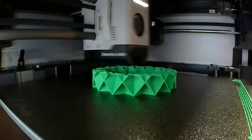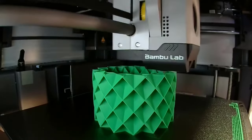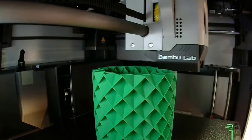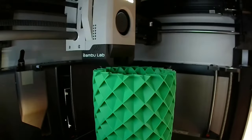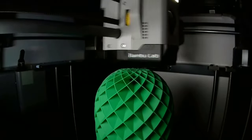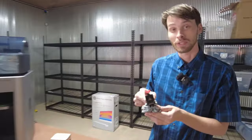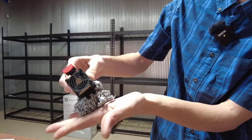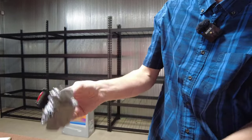Just a few specifications on this printer: 10 by 10 by 10 inch build volume. The chassis is welded steel, the shell is aluminum and glass, and it does have an all-metal hot end. There are different build plates — the standard cool plate for PLA and materials not needing a heated bed, the high temperature plate, and what it comes with: the textured PEI plate, which is an amazing upgrade from the smooth plate. On filament, it supports PLA, PETG, TPU, ABS, ASA, PET, PA, and polycarbonate (PC). And regarding spaghetti detection — here's an extreme example from one of our Raise 3D printers showing what a spaghetti failure looks like. This is what spaghetti protection prevents. The extruder is pretty much shot from this mess. Spaghetti detection saves you from replacing a $35 hot end.